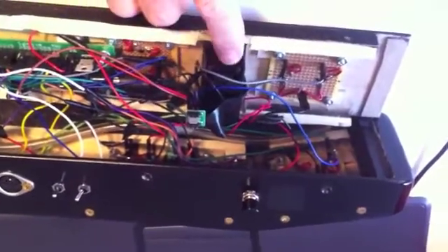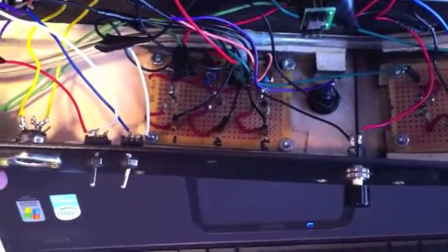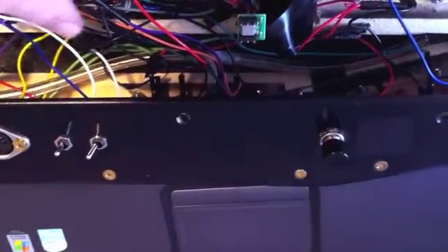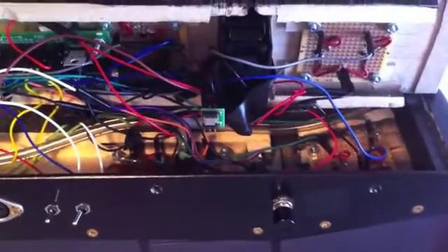The battery container is right there. Each one of these boards has the switches. This is the old version of the MIDI board, and up on the top is the pressure controller. You can see the actual piping come through the Tygon tubing and go up into the pressure controller. You want to put the pressure controller upside down because they're very moisture sensitive, so I put it hanging upside down so water doesn't puddle into it.